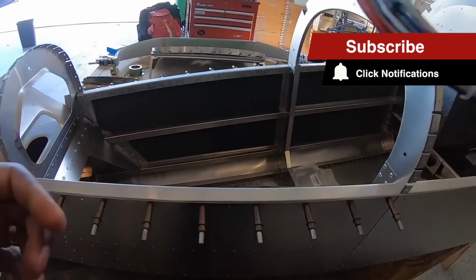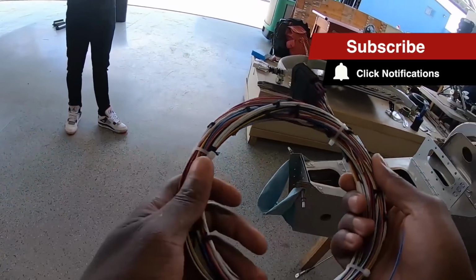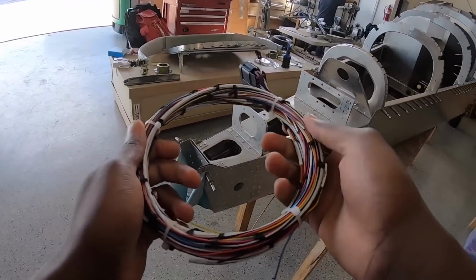So the last video we did, I was working on the wiring and some of the cables in the plane. Today I'm back and we're basically gonna continue that, and also we're gonna mount the GMU. The GMU, or you can call it the magnetometer, is the device that measures the magnetic fields for the airplane, and this is what helps you read the compass that you see on your screen up front. So we're gonna be working on some of this today, and also we'll complete the cable stuff for the rudder and for the strobe lights.